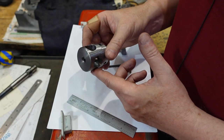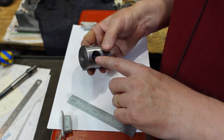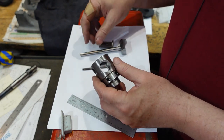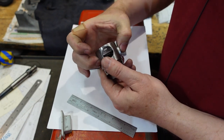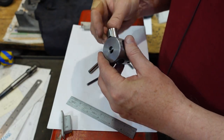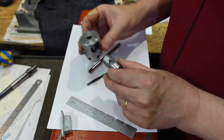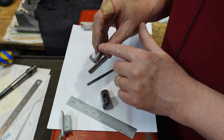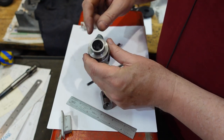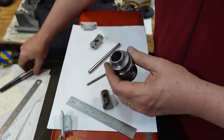I ended up boring these holes to about 0.1 to 0.2 of a millimeter undersize, then ran a ream through there — an adjustable ream, as that's the size I've got. I've now got a size where these parts float in nicely. Quite a bit of deburring was required on both parts, making sure there are absolutely no sharp edges to catch. Even the burrs kicked up by those holes were enough to stop things going in, so I had to take it apart and clean it out.